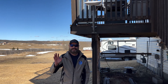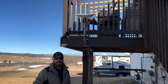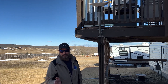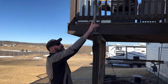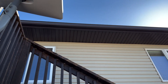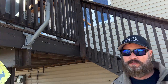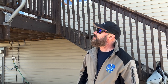Welcome back to All Media Services. Today we're doing a service call on a Starlink system — a Gen 2 system that has some blockage. His signals are still pretty good; we ran tests at 100 plus megabits per second. But he does have interference. If you come close to the dish and look around it, you can see it's pretty low compared to the house — that eave is definitely going to be in line of view, and on the back side of the deck there's going to be some interference. So we're going to mount it onto a pole, extend it just above the roof, get some clearance, and hopefully improve performance.